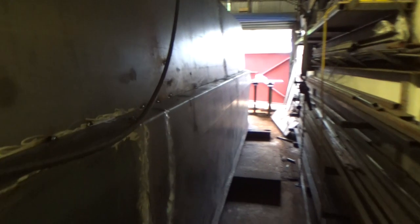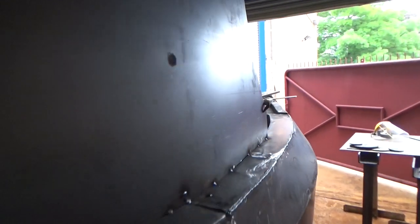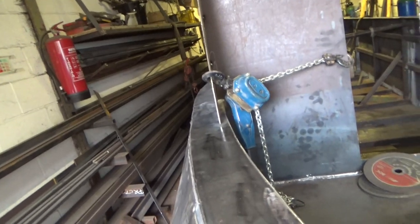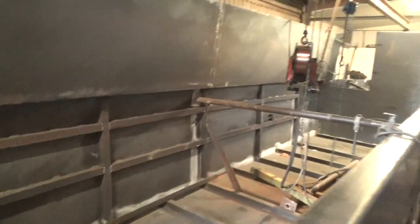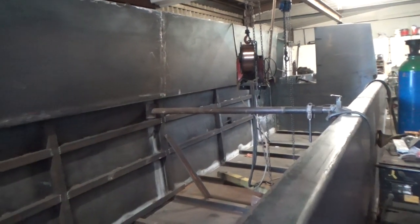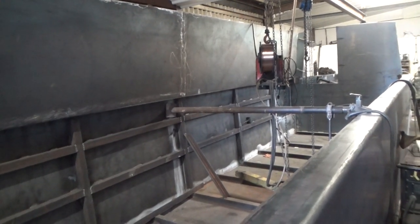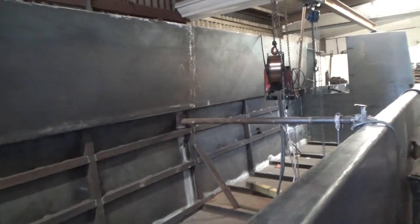Right folks, that's the first side basically tacked on. From the outside we'll wander down — there's still some spatter on from where I've had the brackets and the lever touched on. I'll pull the plate in. From the outside it's tacked on and the clamp can come off now. Wandering around to the inside — there we are, doesn't look too bad for straightness. Next thing is to get angle irons stitched on down that side above and below the window, and then we'll have verticals up and down either side of the windows to stiffen it all up so it'll be nice and flat.